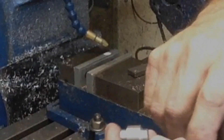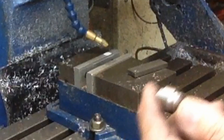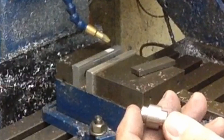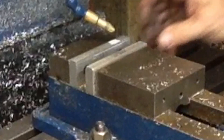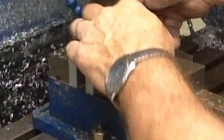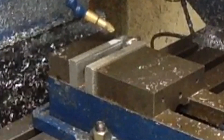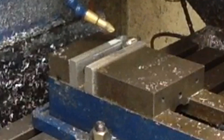Here's our round body. All I'm going to do is set them up and deck off the top. I've already got the machine set up so we're just going to deck this off to height, then go ahead and drill it. One caution about this - this is stainless. Once you get your tools to cutting, you want to keep cutting, because if you dawdle along with it, it'll work harden very quickly and you're not going to get a hole through it. So once you get to cutting, especially on these stainlesses, be fairly aggressive and stay after it - it'll work fine. Low speeds - don't try and run them at 2,000 RPM. When I'm decking them off with carbide I'm running about 2,000 RPM, which is about the max for this machine right now. But once I get to drilling with high speed steel, I'm running slow speeds - only about 500 RPM.